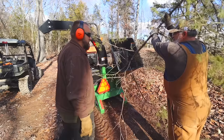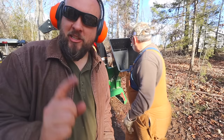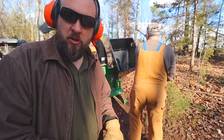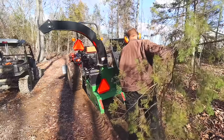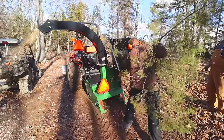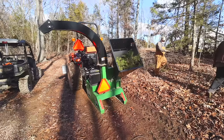After it feeds off, it's going to pull itself in even after that. The always-present problem with a wood chipper is branches — if it catches at all, it's not going to pull through. That's the comparison here: the difference of having an infeed roller. This Frontier wood chipper is a very simple design: the PTO spins a pulley which has three belts that run over to spin the flywheel, and that is basically all of the moving parts. The simplicity of design means there are fewer things to go wrong.